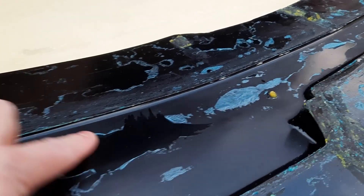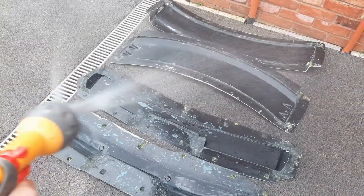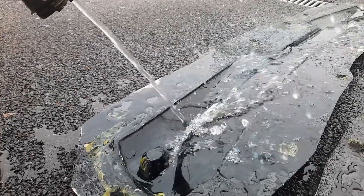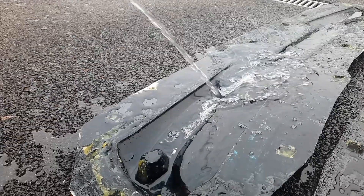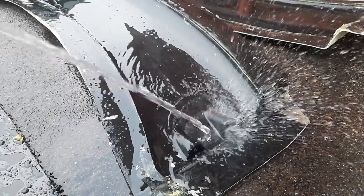You can see on the surface there's still a lot of mold release agent left inside the mold, so that will need to be scrubbed away and cleaned up. This is largely water soluble stuff, so the first step is to leave it just soaking with a bit of water, and to enjoy some gratuitous slow motion replays. All those yellow regions are wax still retained in some of the surface pores of the mold, so I'll be going around with some washing up liquid and a scrubbing brush to get the worst of those off before I use this to make production parts.